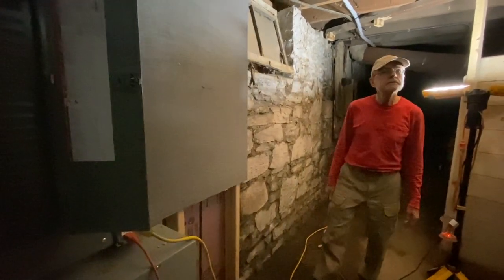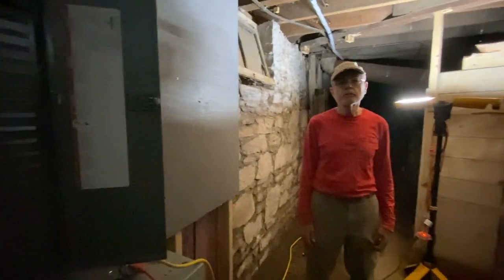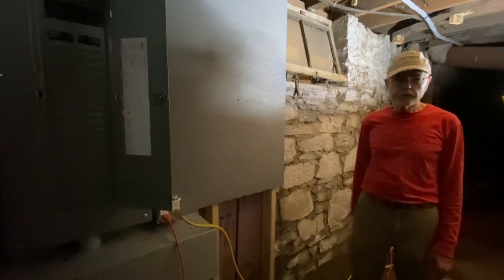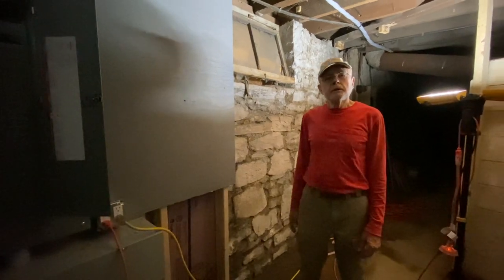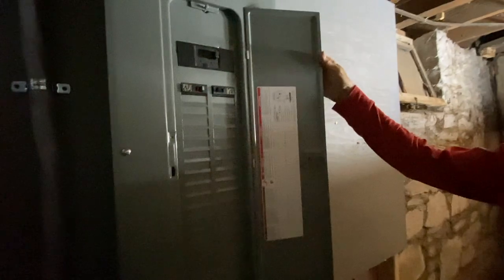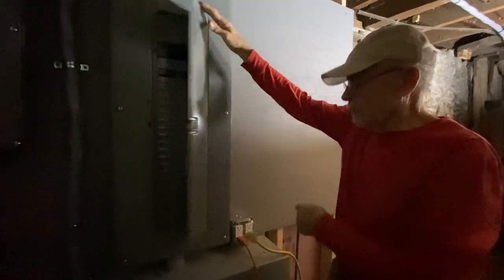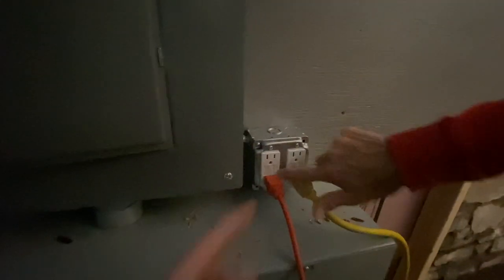As they finish putting wires throughout the house, they'll come down and make separate breakers for each circuit. Each circuit has a circuit breaker installed here. That's why when a circuit breaker gets overloaded, you come down here and reset the connection. These breakers are combination breakers — they have arc fault and series fault detection on them. Then the circuit will run until it comes to where you need a ground fault breaker.